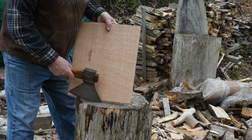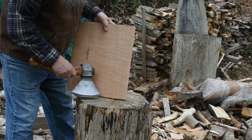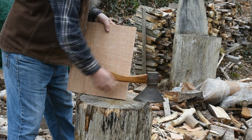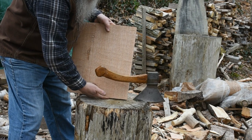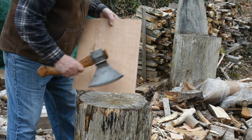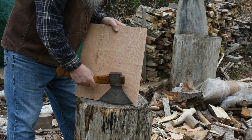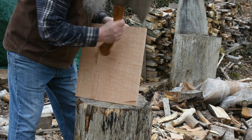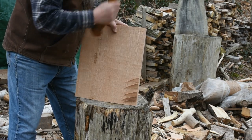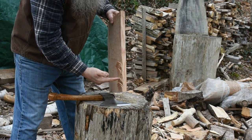So it has to stand up on the block. The block is often hollow in the middle. You want to make sure that there's support under here — that you don't have that hollow when you're hewing. So I'm sort of out near the rim of the block and taking these cuts. And those break up those fibers like that.